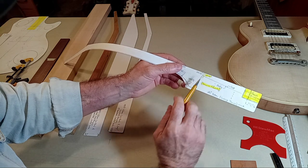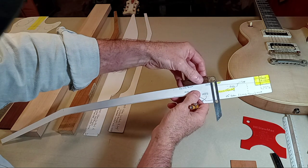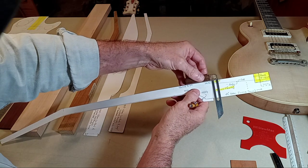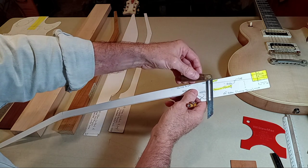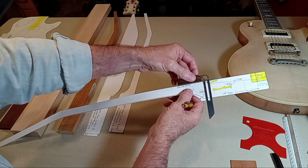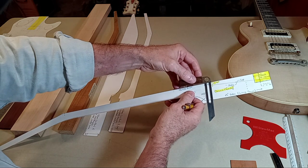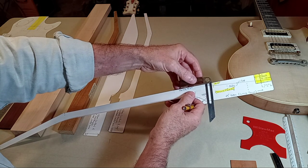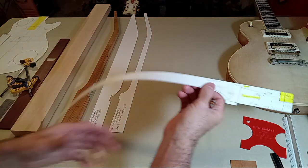You want a four-degree pitch going into the body. Now's the time to make that mark. You want four and a half degrees? You want five degrees? Don't go five — that's too much. Your target needs to be around four to four and a half degrees. That's that angle right there, and we got that behind us.